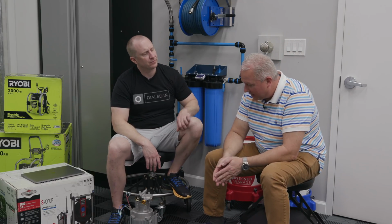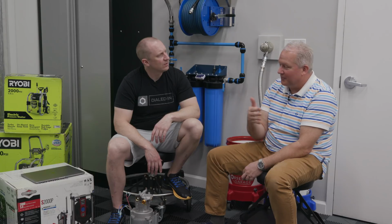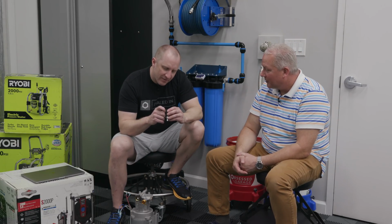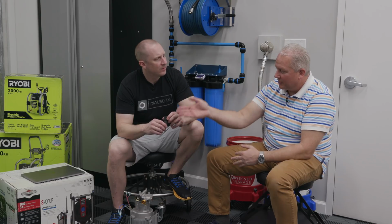So I know you've pointed out a lot in your videos, but that 301 standard basically shows you how to mark a nozzle, right? So I don't have an example here, but there's basically a 5-digit number on the nozzle, right? And this one says 2504. So that's 25-degree, 4.0. That's how this particular company is doing it. This is a Swiss nozzle. Yep. So typically the first 2 numbers are going to be your pattern, right? So if it was like a 15020 or something like that, it's a 15-degree nozzle, 2 gallons a minute, right?